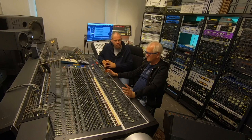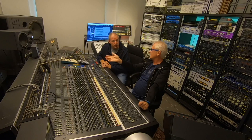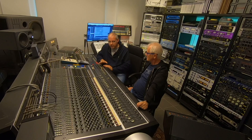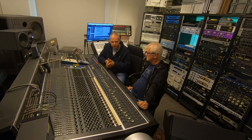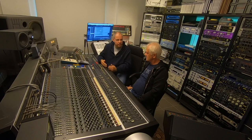You also told me that below these faders it's a little bit different than the SSL. Even from the SSL — it's a gigantic console — I don't want to put the SSL in second place. This is a completely different design because they had to design this for broadcasting companies. The first thing they did is they ramp up the power supply voltages very slowly when you switch this console on. If you switch something electronic on in a very short time, you stress all the electronic components. If you ramp the power supply voltage slowly to its rated value, this de-stresses all the components and leads to a very long life.